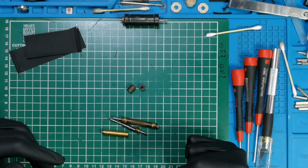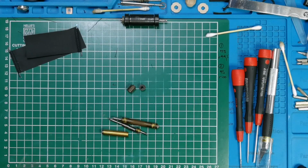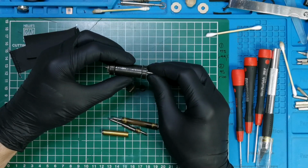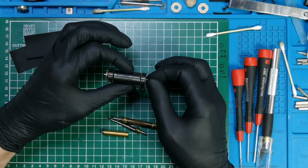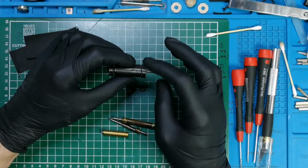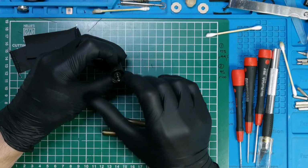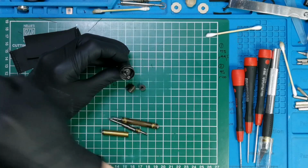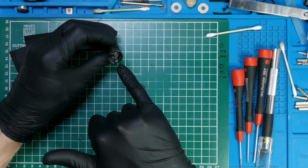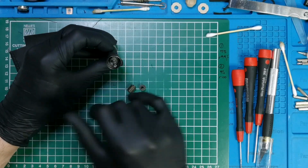Now, I mentioned this thing in a previous video about the workings of the Zorki 4 shutter, and I said that even if these two are moving independently, they are basically connected to the same shaft, but there is no direct link between them except for the moment when they are mounted inside the camera, and that this gear connects the drum to the rollers via a pin that engages in that hole.